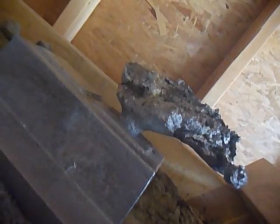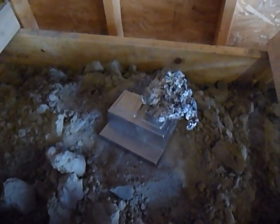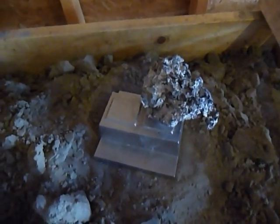I'll just cut that off and I should be good to go. I'll just have to do the tailstock footing and I'll have the whole lathe bed pretty much all set, and then I can get into scraping and try to cast some other parts for the lathe. Good deal.